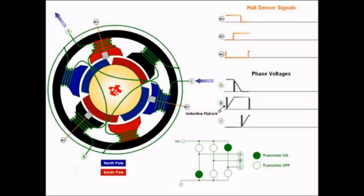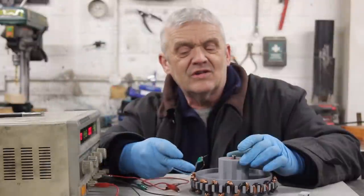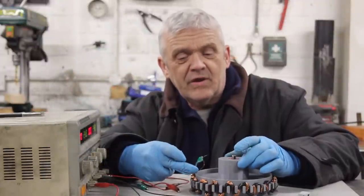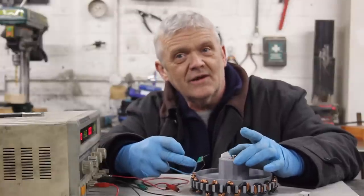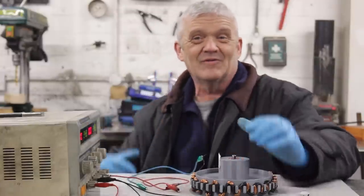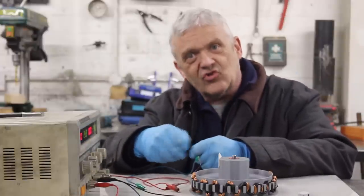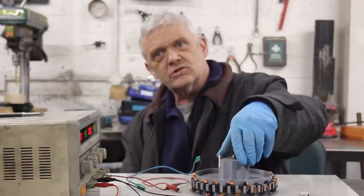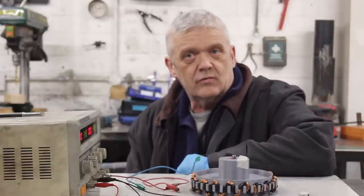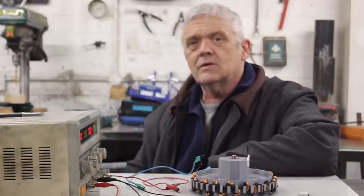This is like a three-phase motor but using a single phase. There's another issue: timing. I have to shove at exactly the right time — if the magnet is in one position and I shove it, it may go one way; in another position, it may reverse. I need to give it the shove in the right direction, otherwise the motor will turn any which way or even reverse mid-turn. I practiced the timing before filming, because touching two wires is the same as hitting a switch.